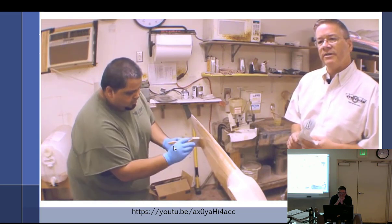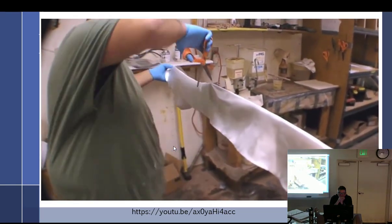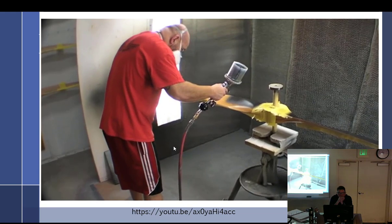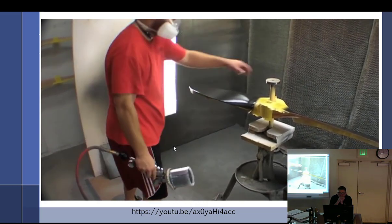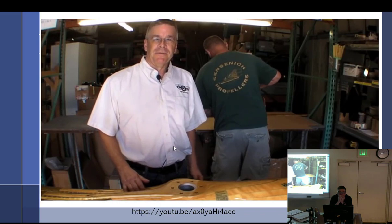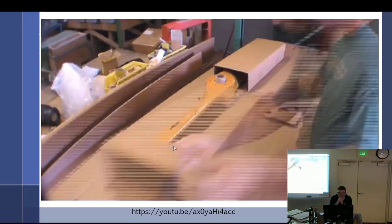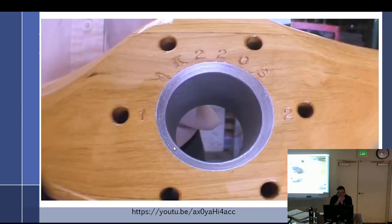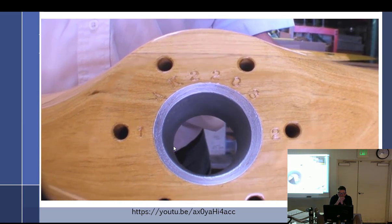After carving, a lot of our propellers get a fiberglass covering for environmental protection. We use a wet layup system with a two-part epoxy and fiberglass cloth squeegeed and peel-applied. For finish we use a marine spar varnish — very durable and it will darken to a nice patina over time. After painting the propellers come out for final inspection and application of the Sensenich trademark before being packaged. That metal-looking sleeve in the center is actually an aluminum pigmented paste painted in there to seal the end grain. You can find more at www.sensenich.com.